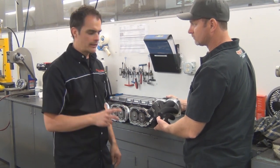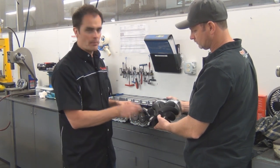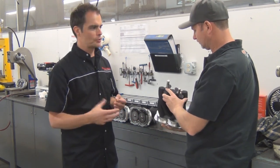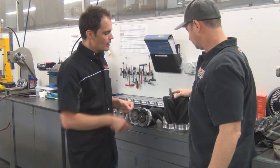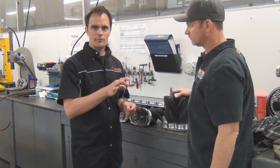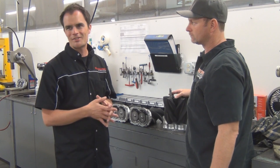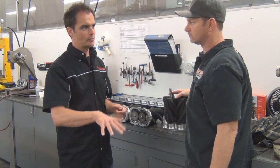The other thing that we'll look at later is the bypass valve. Every Eaton or every Magnuson supercharger has a bypass valve system. One of the things people talk about in old school root superchargers is the fact that it's creating a drag on the engine. It's running off the accessory belt, right? On these, they actually have a bypass valve. So when you're on vacuum, when you're not on boost, the bypass valve opens. The air is basically going straight through. It's not spinning the rotors. So you have no parasitic drag to speak of on the engine. So basically you're getting the same fuel economy as before you put the supercharger on. So you're not actually using any more gas until you really get on it.